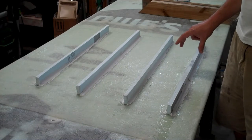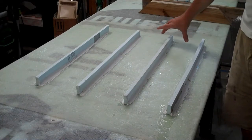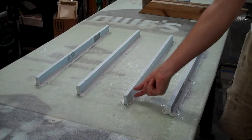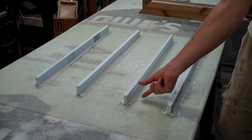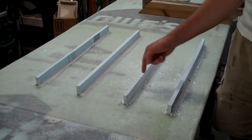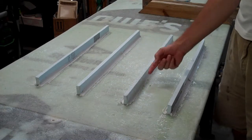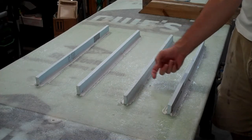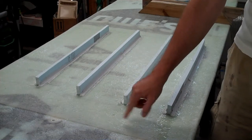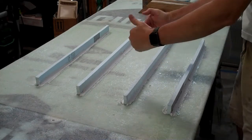Cut epoxy. I'm going to be doing 6-inch wide woven fiberglass tape to go over the whole thing to begin with, and then I'm going to be doing small pieces like 1-inch tall chop strand mats to reinforce the sides, and then some maybe 2-inch tall chop strand mats to curve around there. So I want about 3 layers of chop strand mat on both sides, plus the woven fiberglass on the bottom, plus I'll do a 3-inch woven fiberglass on the top to kind of cover in, because these chop strand mats are going to just kind of stick up at the top here. So it's going to be a little bit more fiberglass than I do for one of these full deck boards, but not a whole bunch more, and mostly it's just because it's in a vertical orientation, 90 degrees to the deck board, it's going to support it this way quite a bit.